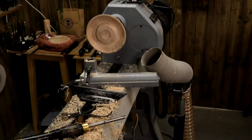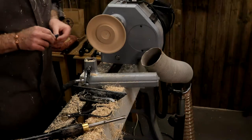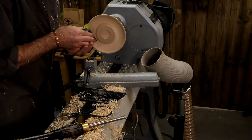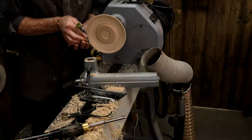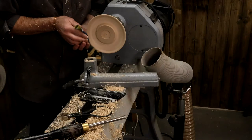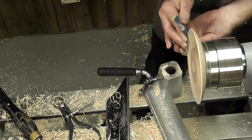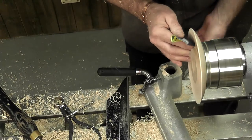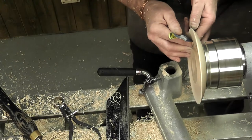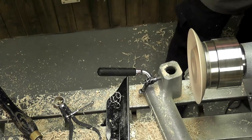Even at this stage now, I could actually sand this, try and maintain my equal thickness, because when I take the middle out, we're going to lose more. So 150 grit. The band, we'd have a bit of a rolled rim, so let's just blend this in with the abrader. If I go with the chisel, probably a bit thin there now, we run the risk we splinter that short grain section off down the grain. Gonna roll that over. So a 150 at this stage, just helping us keep our thickness and make sure it looks equal. 150. Do a little bit on the 240.